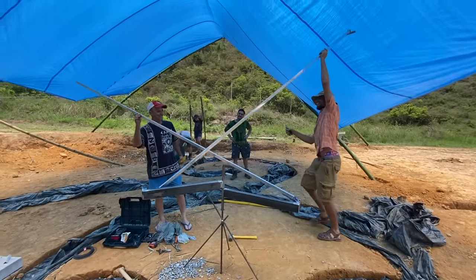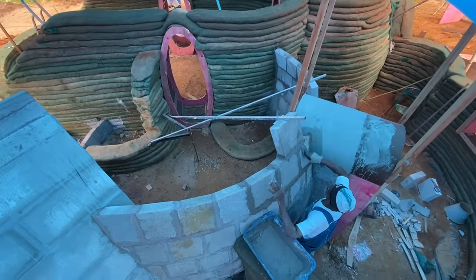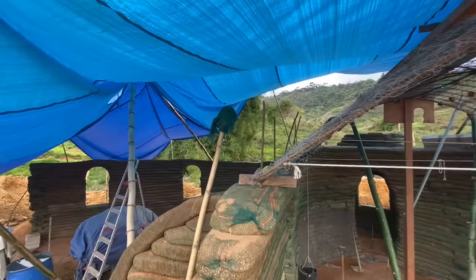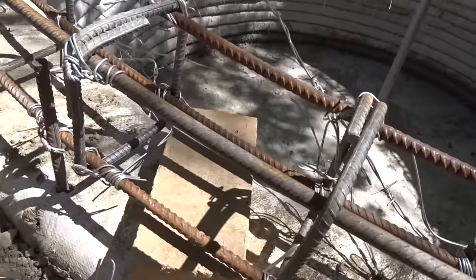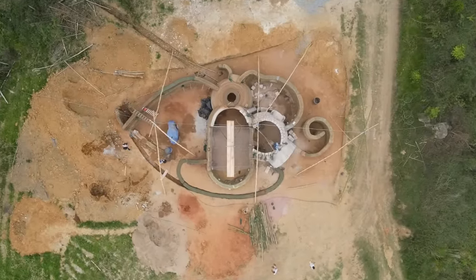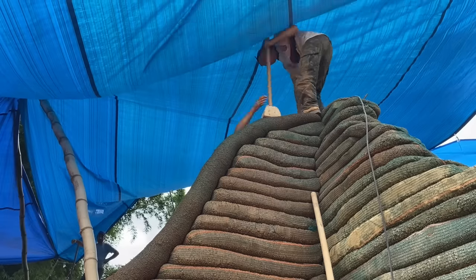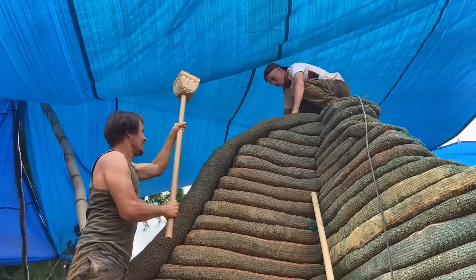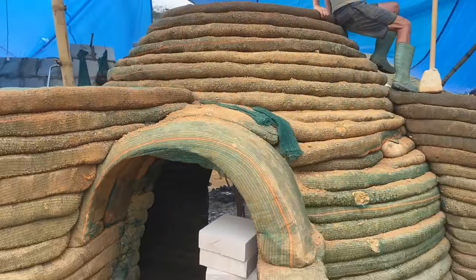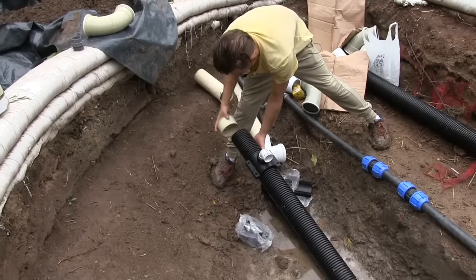Make a 3D egg compass we developed with Arthur, our host in Brazil, that allows two teams to work simultaneously laying bricks in an egg-shaped dome. Make the necessary details for the connection between the vaulted roof and the walls. Use buttressing — important structural pieces that keep the vault from popping out when pressure is exerted from above. Use hyper adobe for advanced techniques and finishing touches. Build a dome using hyper adobe including window eyebrow details. Set up the passive air conditioning pipe and channel that air into your home.